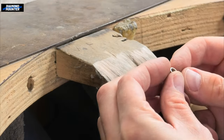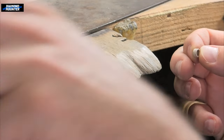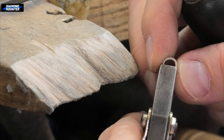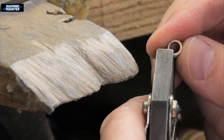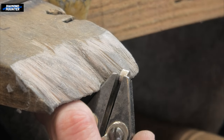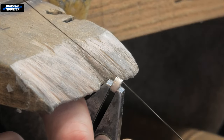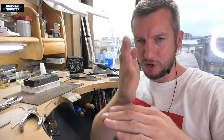Before you tap it round, you've got to solder it up. I'm going to cut through the join to make sure it's as tight as possible — mine is pretty good but it's also still a bit too big. A top tip: hold the collet with parallel pliers directly underneath the join and cut straight down. That way, when the blade goes through, it bangs against your pliers rather than damaging the collet. Even so, don't cut fast — work carefully, making sure you're going straight over the join and straight down.